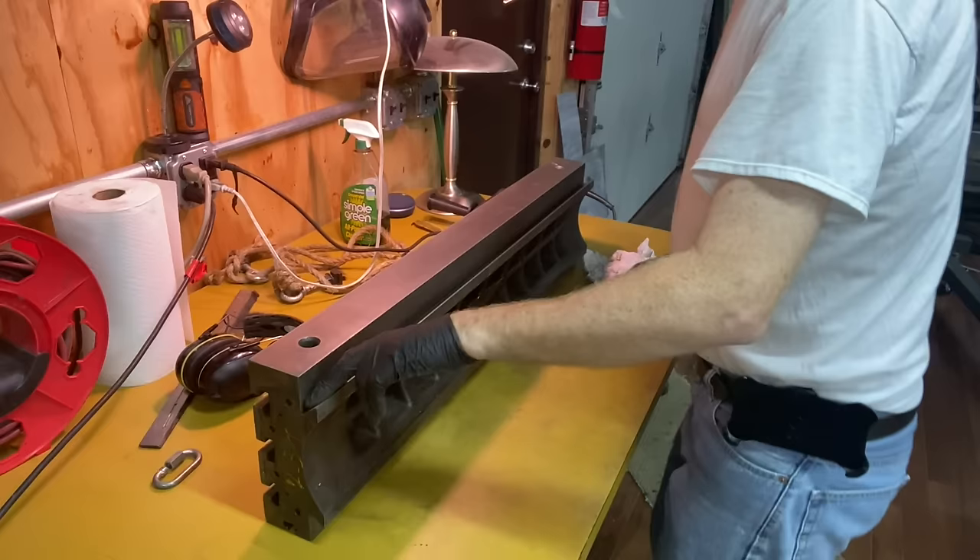Okay, I'm going to cut it off there. I think the table looks a whole lot better — to go from that rough surface to now being smooth. Relatively flat — the middle part was down as much as ten thousandths, but I think for an old mill that's pretty good. Anyway, I hope you enjoyed it. If you did, thumbs up and a comment. Thanks, and come back for next time. Peace out.